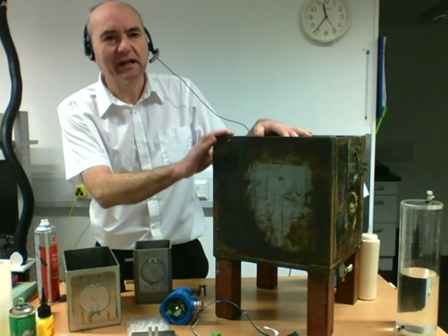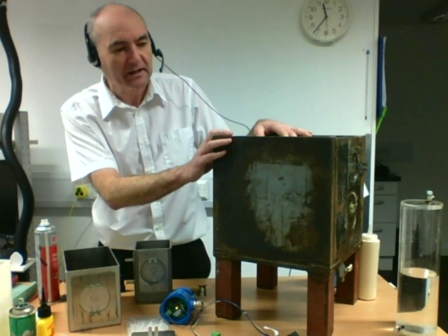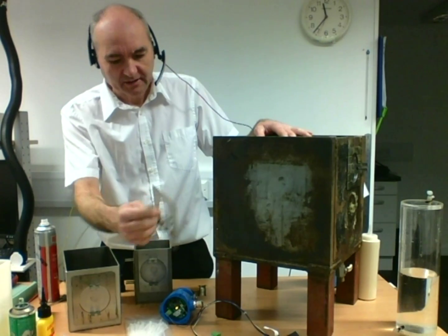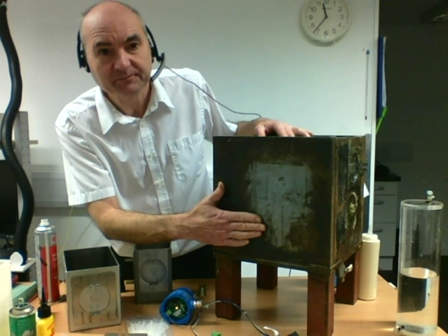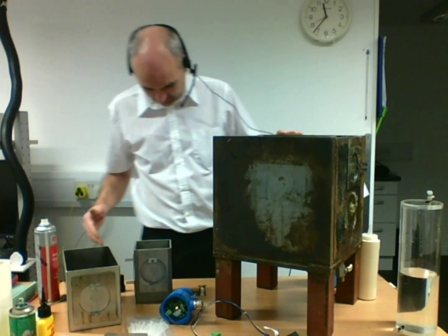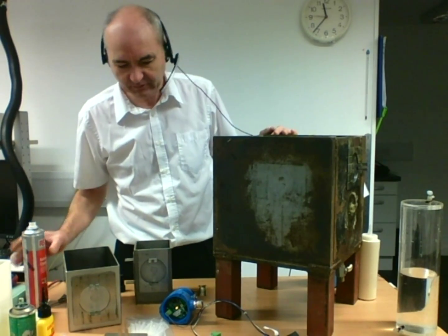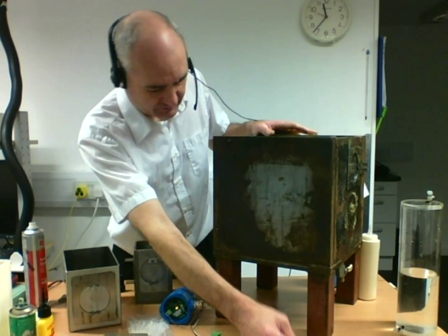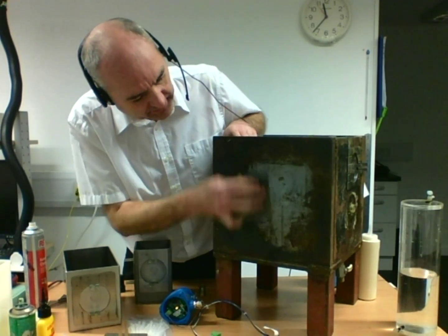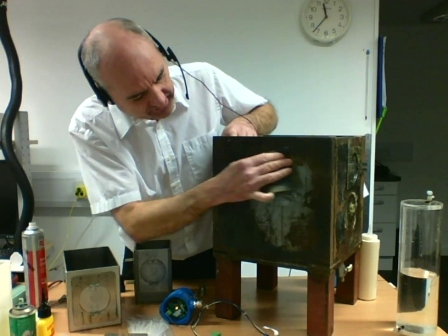Assuming that we have found a place where the spot check is performing properly, we would then go on to mount the brackets to the tank. The first thing to do is to make sure that the surface is clean. There are two processes: one is to use a solvent cleaner to remove all the grease, which will help the adhesive to stick. The other is to use some emery paper to roughen the surface, so abrasive paper will rub all around this area here.